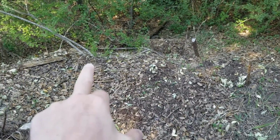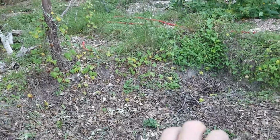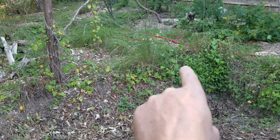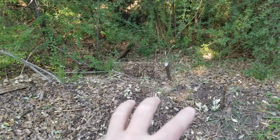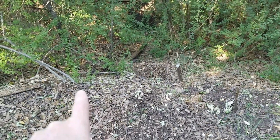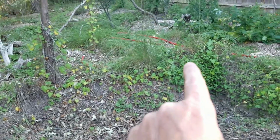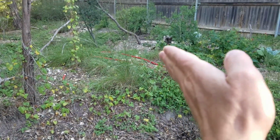So now this drain was supposed to be the second drain. I probably haven't mentioned drains yet, overflow drains, but I have an overflow drain here. That's the first drain. It's lower in elevation than the second drain. But now that this has started to break down, the second drain is now lower, so it drains here first, and I don't want that. I want it to drain on this side first because that's higher in the landscape.